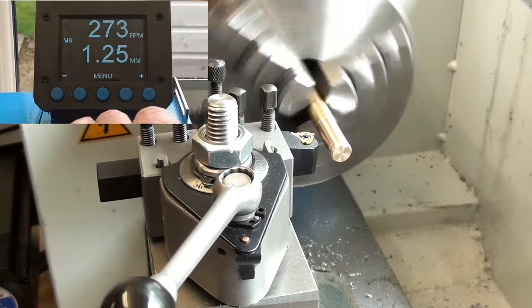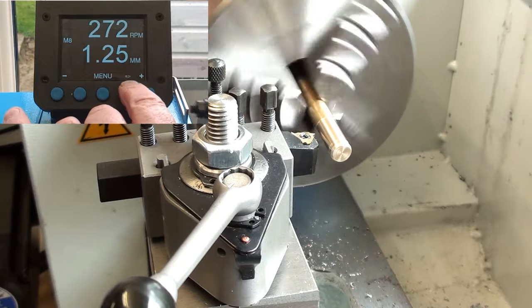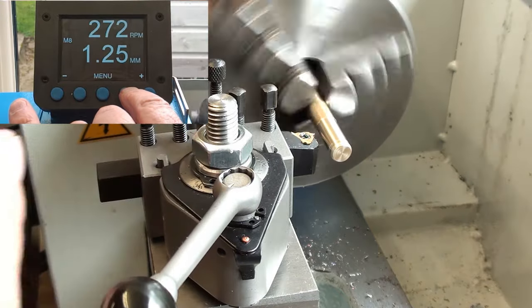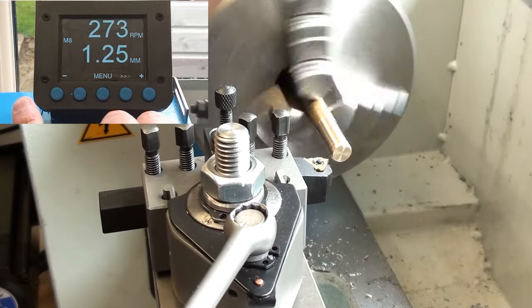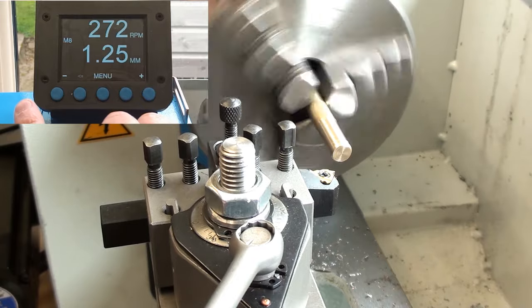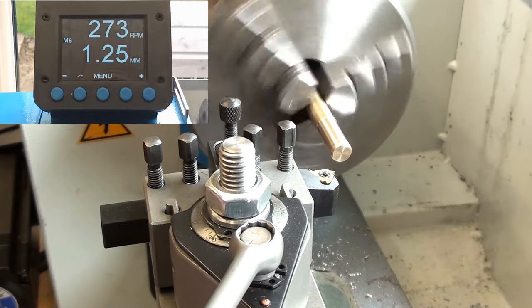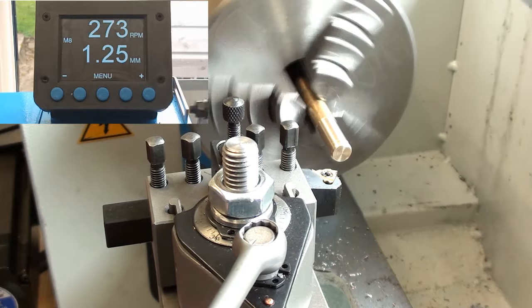Then theoretically back out the tool. This is now flashing away from the spindle — it will come back towards the tail stock, overshoot by 5mm and then go back by 5mm to take the backlash out. Rinse and repeat, and we should end up with a thread.